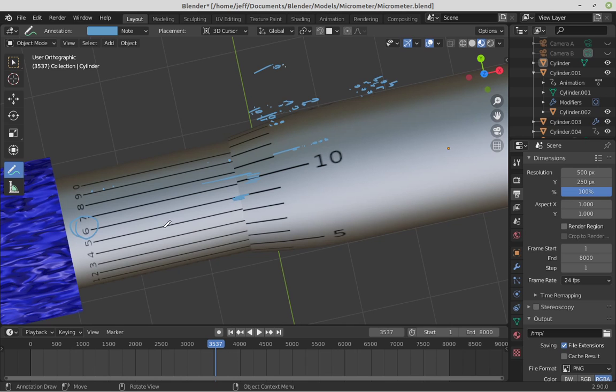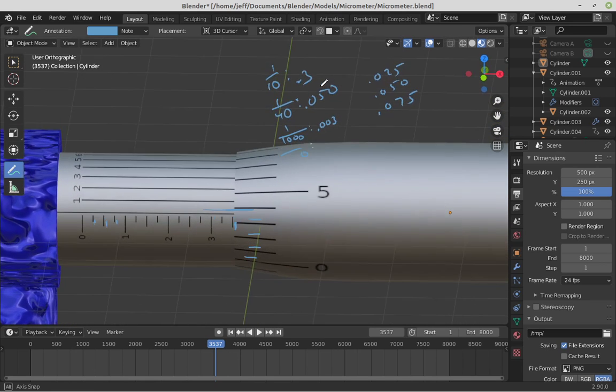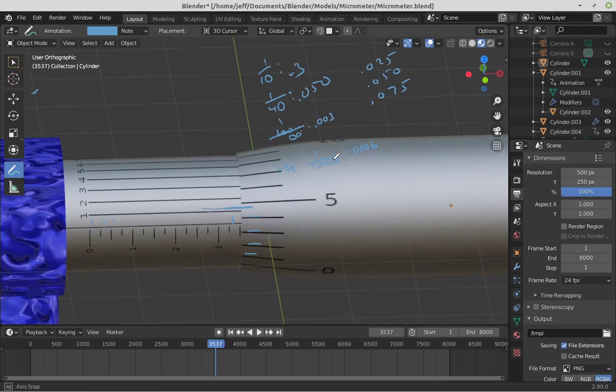It's the 6. So your final scale, we have the thousandths. That vernier scale is the 10 thousandths. And I said it was a 6, so this would be 0.0006. And to get the total measure of where all this stuff was, I think that was a 6, wasn't it?